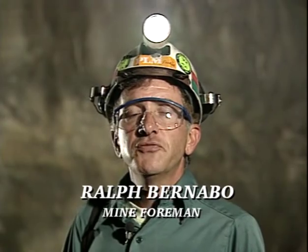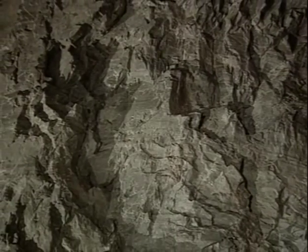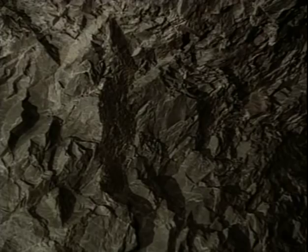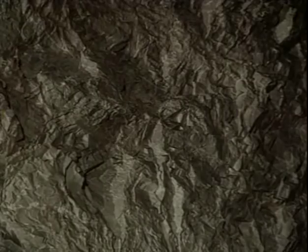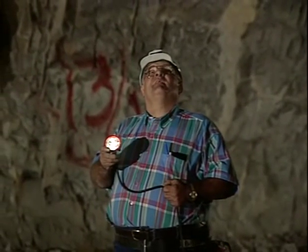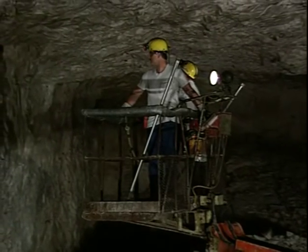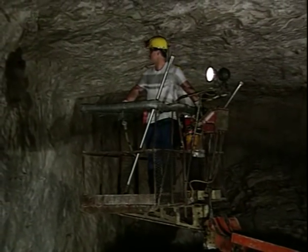When we examine the work area in the mornings before the shift starts, we start at the last intersection and work our way in examining the rooms. You may not be able to see any cracks that are prominent if you're looking in only one direction — you must turn and look at different angles while examining the work area. I want to see what kind of area I have that I'm going to send my people into, and that it's a safe atmosphere. As I'm examining it, I'm deciding what kind of equipment I need — whether I need hand scalers, a mechanical scaler, or whether I need to use a grader.